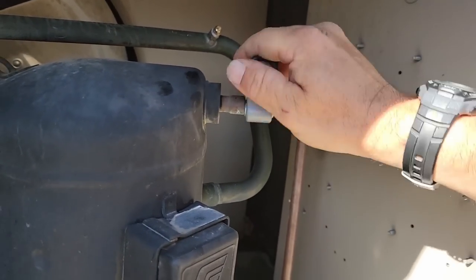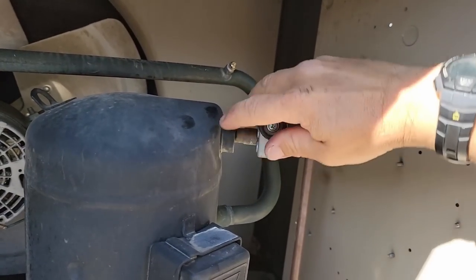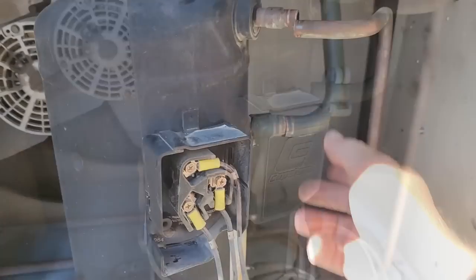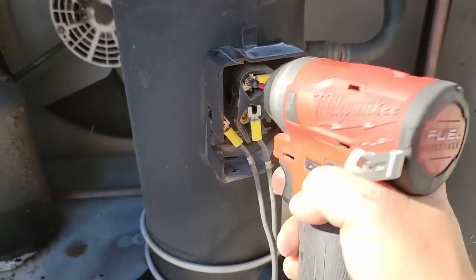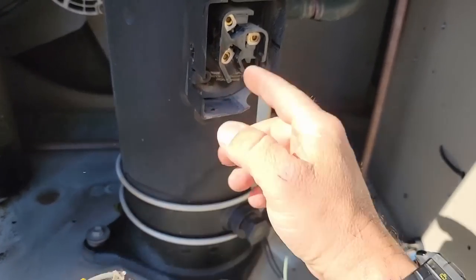Normally I sweat these out, just depends. Manufacturer says don't unsweat them — they're working on R410A, definitely don't unsweat it. I'll take them out like this but don't put them back on like this — good way to snap it off. These are numbered: one, two, three.